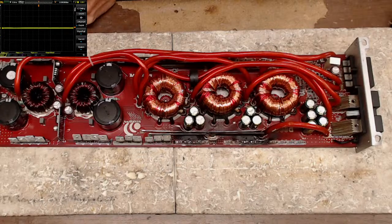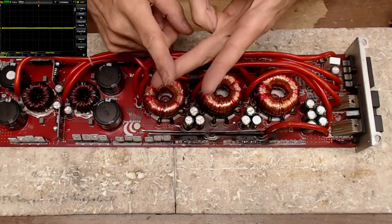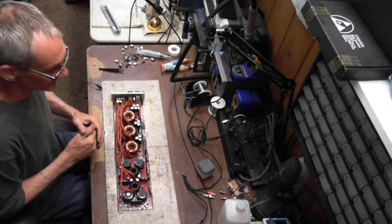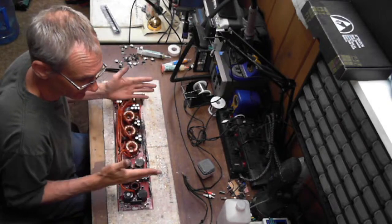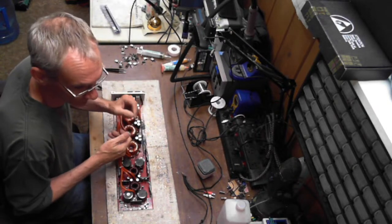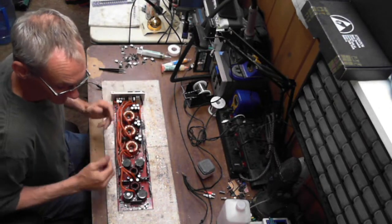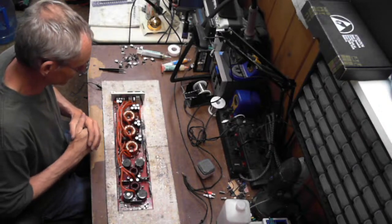Let's see here. If you have to order the transistors, how do you get matched pairs? Well, that's the nice thing about ordering from DigiKey, Mouser, any distributor here in the States. Again, mainly here in the States, or even LCSC. When you place an order for transistors, you usually get those transistors from a batch. From what I've noticed, they don't have bins of parts that they just pull the part from. They will come in a holder, and they will all be in line with the same date code on it. So I've never really had to worry about not getting matched components from places here in the States.